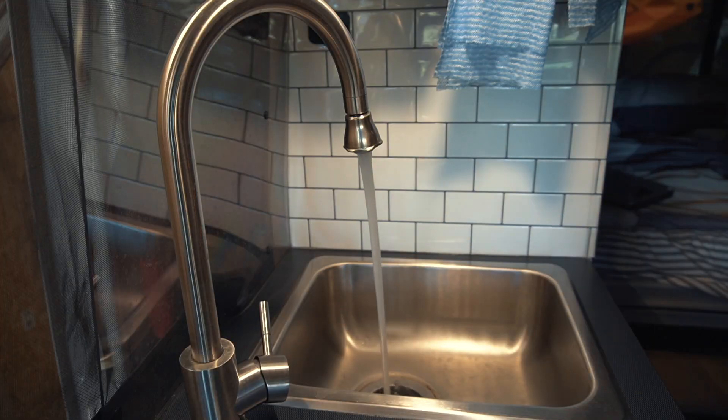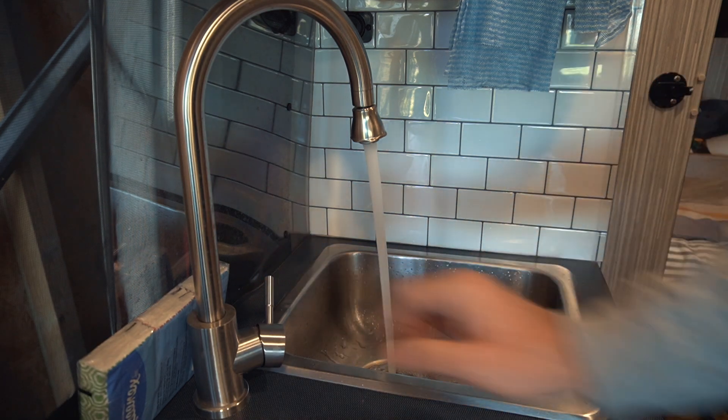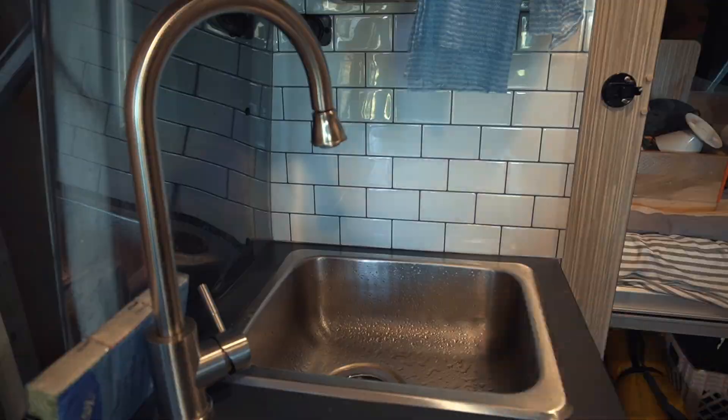I'm placing the second microphone down by the water pump so you can hear it running. First, let me turn it on full blast. What I immediately noticed is that the pump does not kick in right when the water faucet is opened — it runs a little after it's been closed. So the tank provides pressure first, and then when the faucet is turned off the pump fills the tank back up. For test number two with the faucet turned on only a little, the pump didn't turn on at all — all the pressure was provided by the accumulator tank.